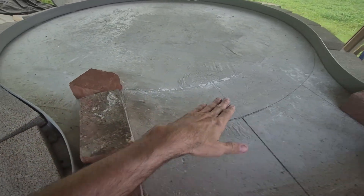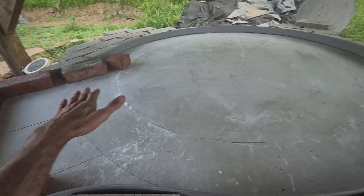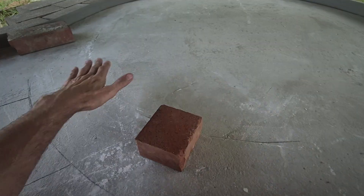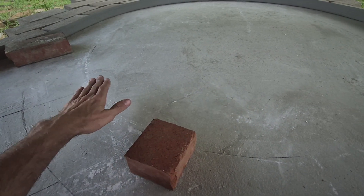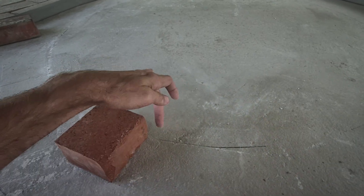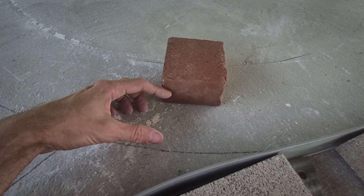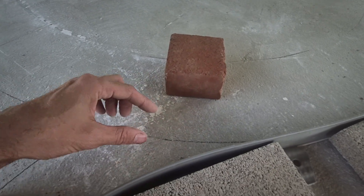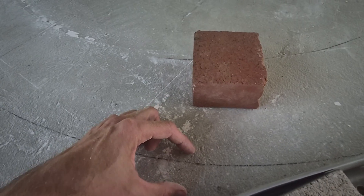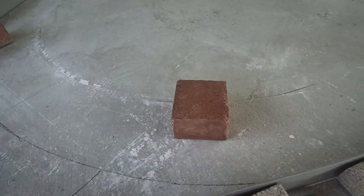So now we're going to pour this with two inches of vermiculite, then we're going to put our entire pizza oven hearth or floor on top of that. Then the brick dome after we've got the insulated concrete. Then it's going to come two layers of calcium silicate board — one layer on the outside where the bricks set, and then one inch outside where the bricks sit. This is where the actual dome is going to rest. Then you're going to have three inches of insulation — three inches of one-inch ceramic fiber blanket goes here. Then you're going to have your dome, your actual rendering of the dome, which I like to leave two inches for to get a nice strong dome. And you're going to render your dome up over the blanket after you've laid some chicken wire. So those are pretty much the basic setups.